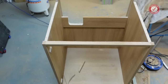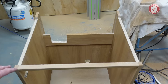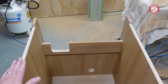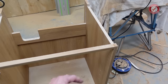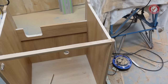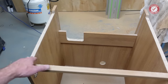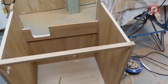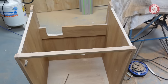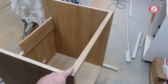The top of the sink needs to be perfectly flush with the top of the kitchen units. You also have to consider: what happens if the sink gets damaged — how would you ever get it back out if it's sandwiched over the top of the edges of the unit? So that's not really an option. You've got to cut away — either route or jigsaw — the top of the unit so you can get the sink in from underneath.